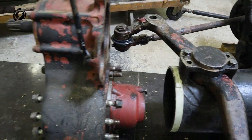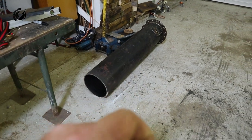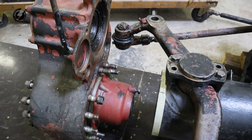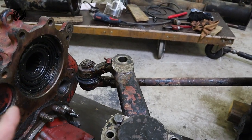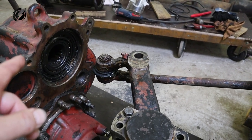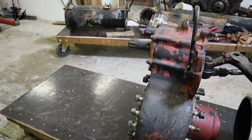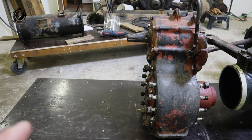So we are going to cut this piece, the second piece of this tube, exactly to the length of this distance over here, and then we are going to connect the Tesla motor to this input, which is the original input from the Tatra transmission. And the last thing: you might be asking why we are cutting and shortening this tube.